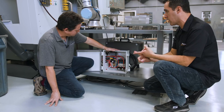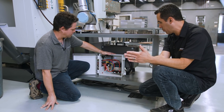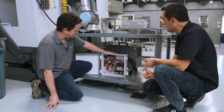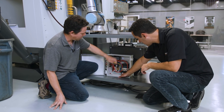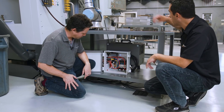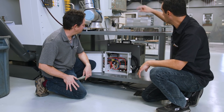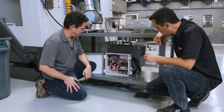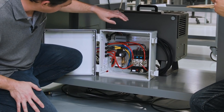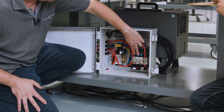The two-way valve handles the auto door because the piston needs to be pushed open and retracted closed. One line goes to the vacuum power unit — a VPU in the bottom — which is always left on. That runs to the end-of-arm vacuum cup. The next three one-way valves are unused at the moment.